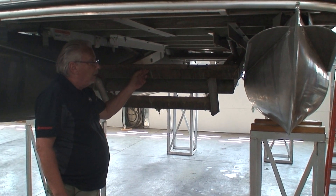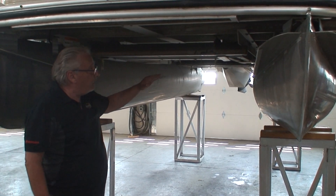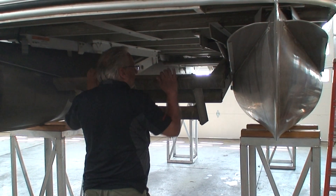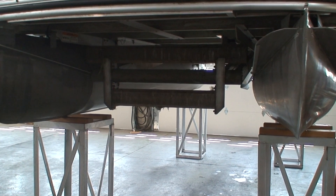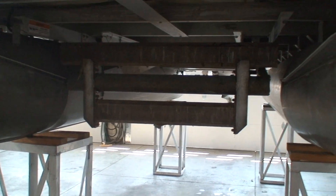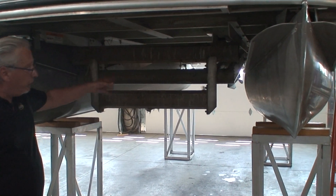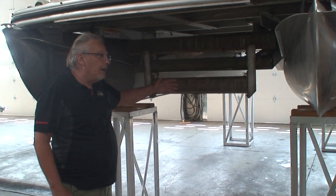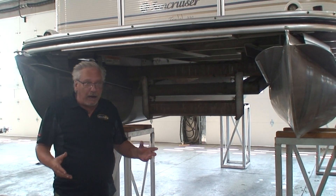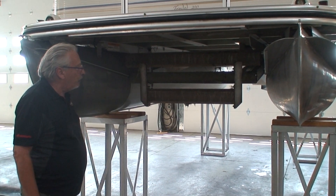If you raise the front legs, that's what it's designed to do — it's supposed to go back to flat. But sometimes when we get rocks in there, if we lower the legs again and had a rock in there, we raise the legs and they get jammed. Imagine trying to drive across the lake with the legs in that position — it's not going to work. Whether this happens to the front set or the rear set, as you're driving along it creates so much turbulence in the water that the motor's shaking like crazy and you're only doing 7 miles an hour, and you swear there's something wrong with the engine. But it's not the engine — the engine isn't getting solid water. It's the sea legs creating all that turbulence.